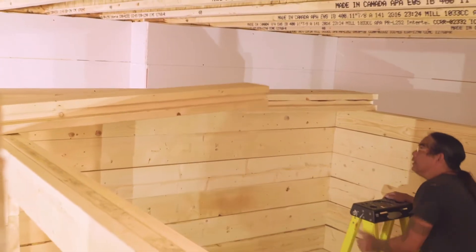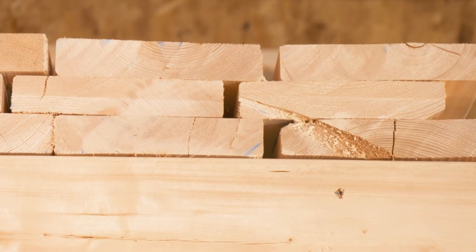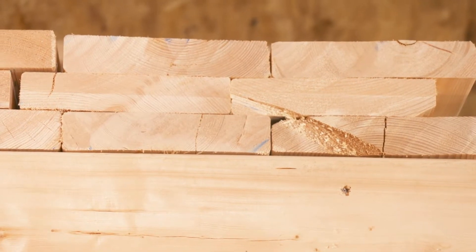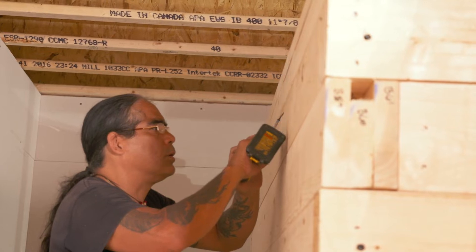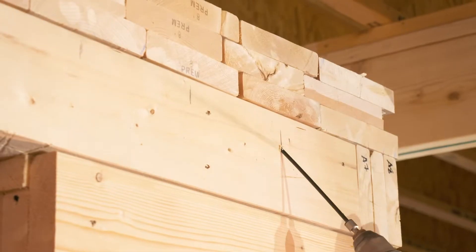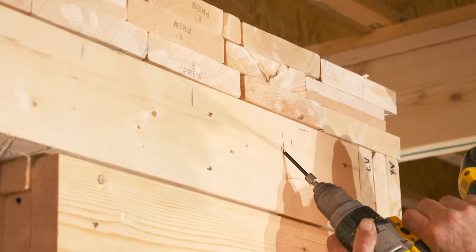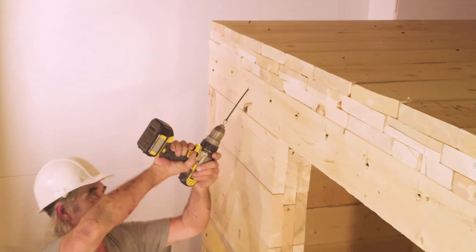Because all the beams in the ceiling are 8 feet long, the ceiling is constructed by simply fitting the finished beams together. Installation begins with the starter beam. It is laid on top of one of the walls, flush with the edge and manually held in place. Then an 8 inch wood screw is driven at each end of the beam, through the wall below at a 45 degree angle.